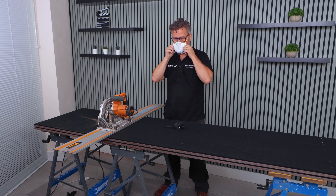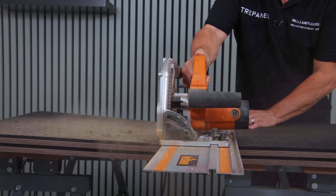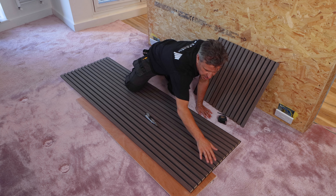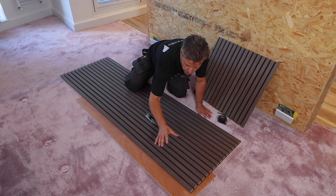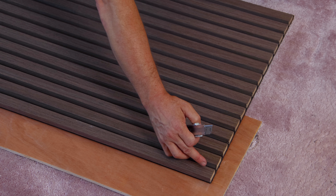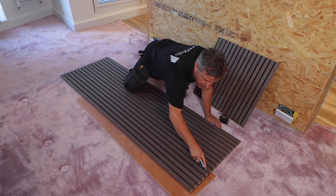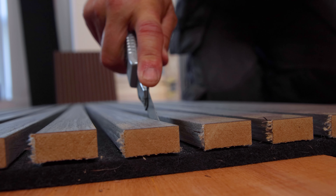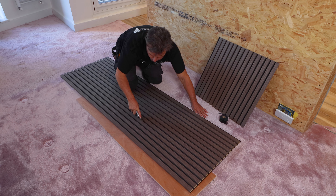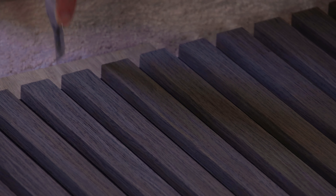The sheets come in 2.4 meters but I only need 1900 millimeters high, so I'll cut all four pieces down to the length I require — about 1900 mil. I'm going to start with the very edge of the headboard itself, which is 190 millimeters long. I'm just going to get my trimmer knife and cut through the felt behind them. I've got a piece of plywood underneath here to protect my carpet, so do be cautious when you are cutting these.